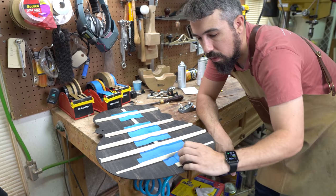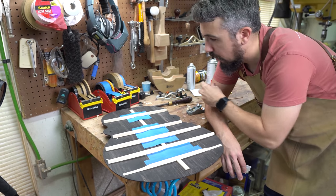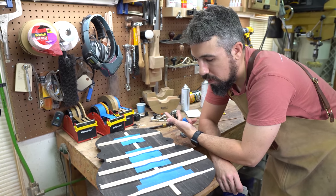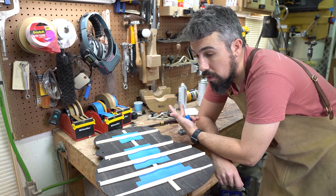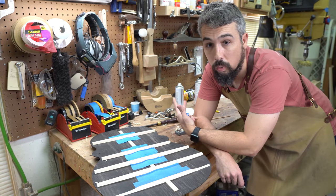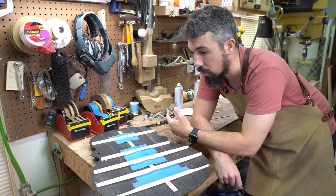At that point I can pull this tape off and call that finished. We're going to do the same thing and move our way up the back of the guitar and just keep chipping away at it. As you can see, it's just a lot easier — there's not as much to consider because you don't have 110 to 180 pounds of tension on the back of the guitar like you do on the top. It also is not the primary sound generating surface on the guitar, though it does contribute to the tone.